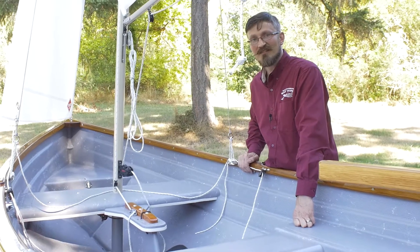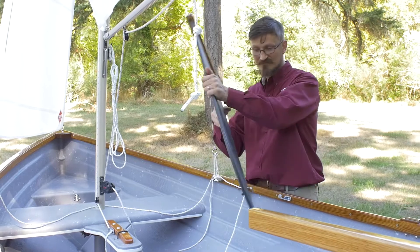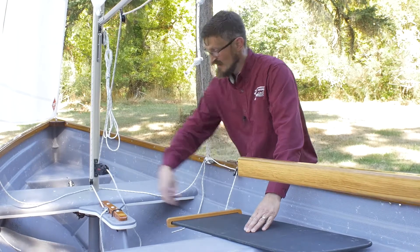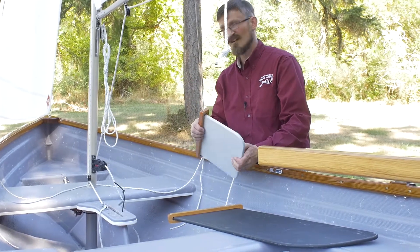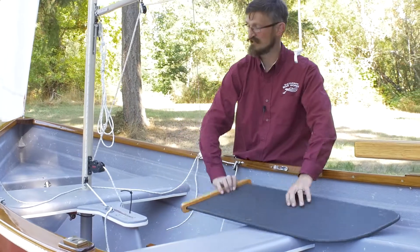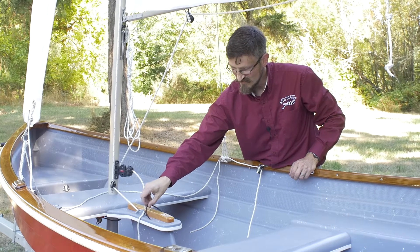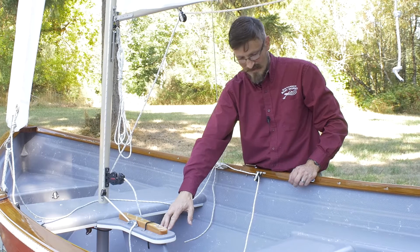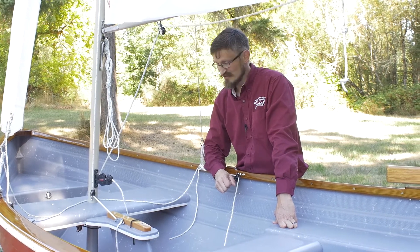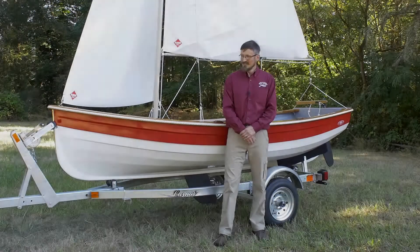Once you have the rudder in and the boat launched, the last piece you need to worry about is your dagger board. Just as solid and as heavy as the rudder is, you won't actually be able to put this into the boat until you've got some water under your keel because it does project down below the bottom of the boat a little bit. You currently have a dagger board plug in the trunk — this is more or less a cosmetic piece. It keeps the water from splashing around in the trunk too much, keeps you from catching your fingers, and basically just looks good. Pull that out and leave it on the beach. Put the dagger board into the trunk, just lower it down, and use the bungee cord to secure it to make sure it stays with your boat. You can sail the boat without the dagger board fairly reasonably well — it won't track into the wind particularly well, but you can sail off the beach and once you have a little bit of water around you and room to get yourself straightened out, go ahead and put the dagger board down. And that's it — you're rigged, you're ready to sail.